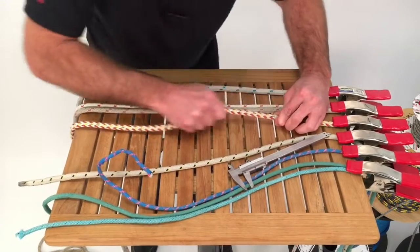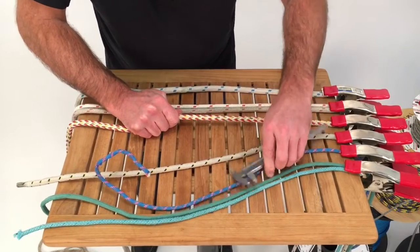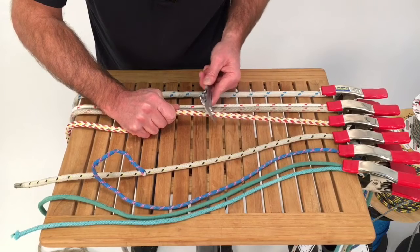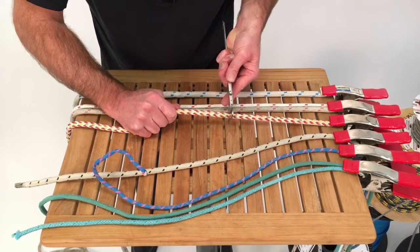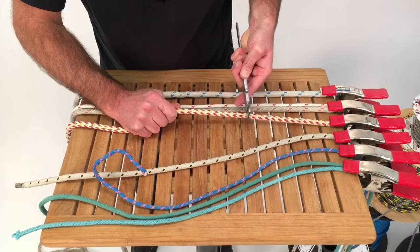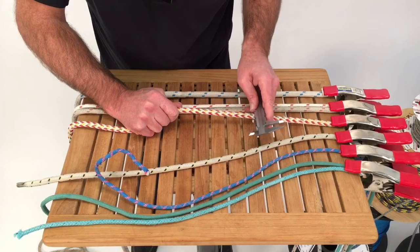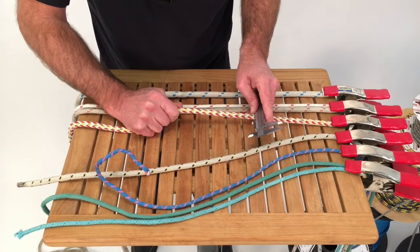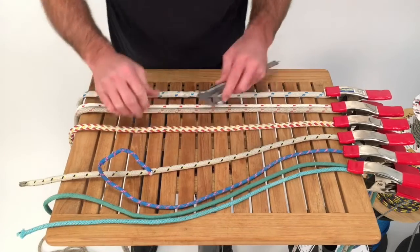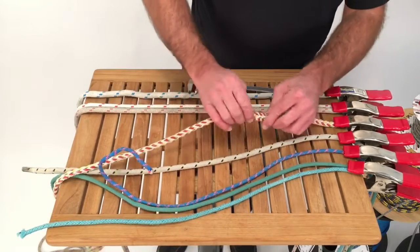So my challenge here is to really get the constructional diameter out of it, get it under load, get the caliper on, run it down. And this one I'm rotating, I'm making sure I'm hitting all those different fibers, that I'm not measuring a flat spot. And wow, that's a solid straight on 3/8. 1, 2, 3, yep. So super confident I've got a 3/8 12 strand.